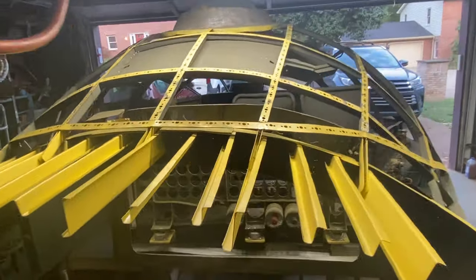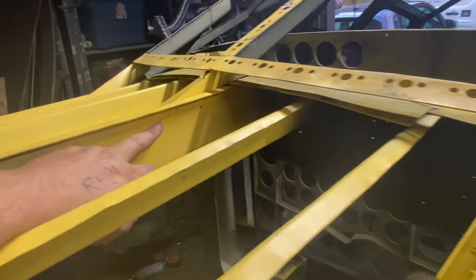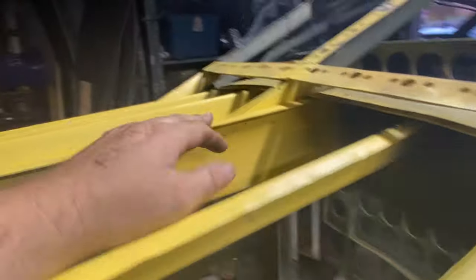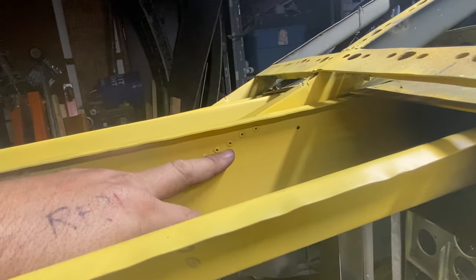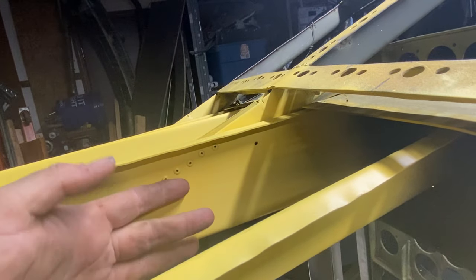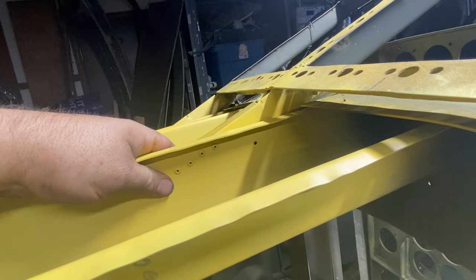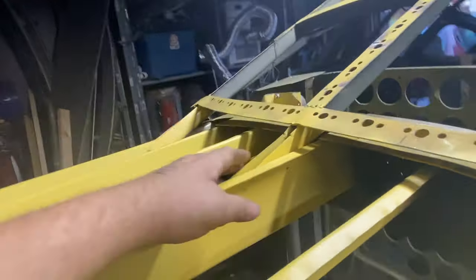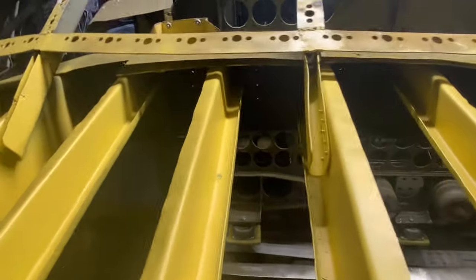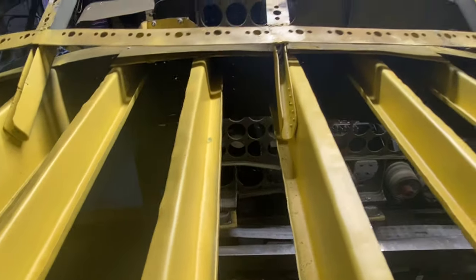Something I've just realized — I questioned for so long how these longitudinal canopy frames attach to the fuselage back here. As you can see, the only difference between mine and the real B-36 is they used threaded fasteners — or I've just riveted them in. I might go ahead and do the threaded fasteners once I study this area more to determine if they used double sides here.